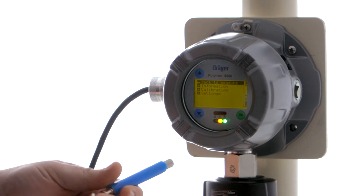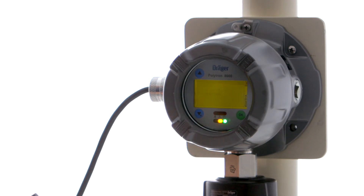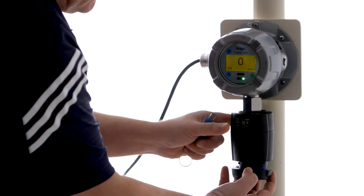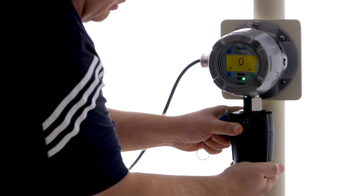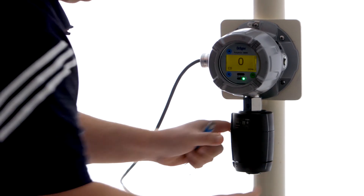Go to the top level menu — you can keep hitting the up arrow until the menu that says 'Back to Measure' is selected. You can say OK. Now our unit is warming up — our new sensor is warming up. Now we're good to go. So then we replace our retaining ring and we're done.